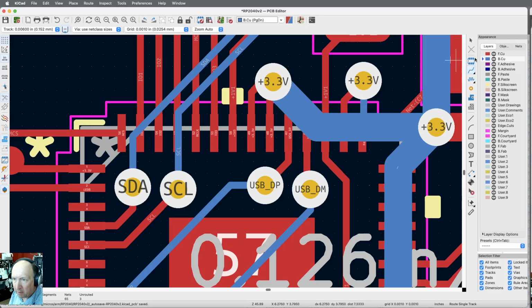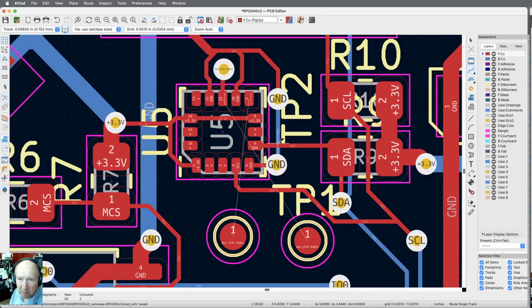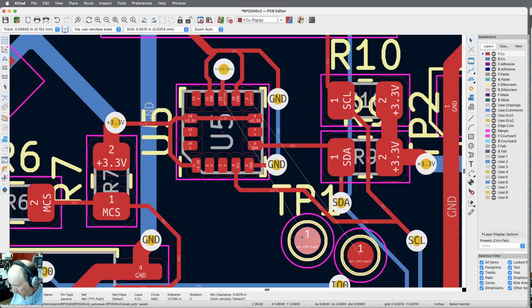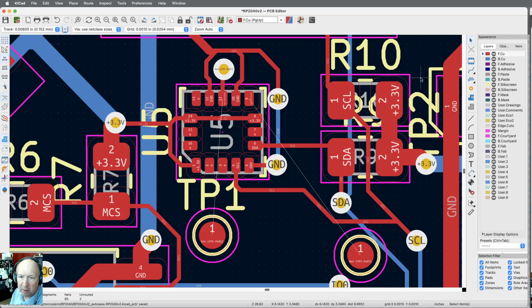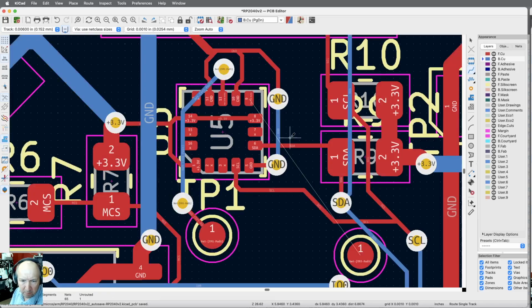Okay. Back to red side again. And this one, we're down to 2. And that's the test points. So let me move this one over here for the moment and move this one over here. Probably won't even need these, but I thought I would put them in there. And 6 mil via, and then they connect up to that one. 1 trace left, and I just want to come down to there for that.